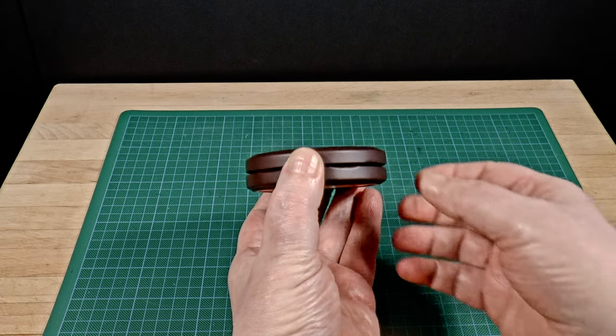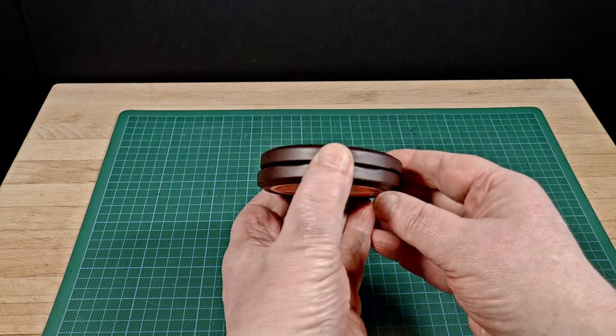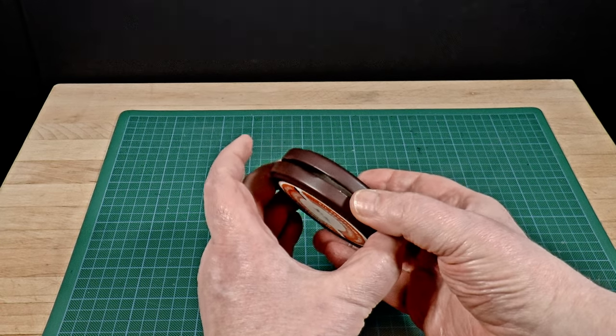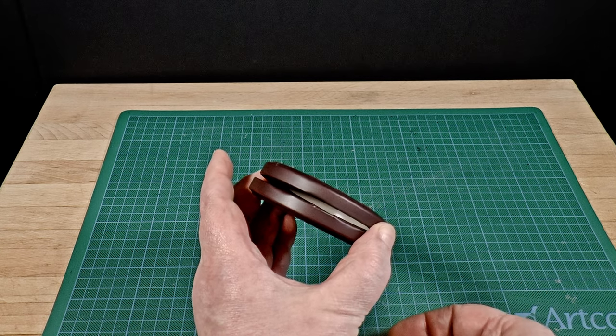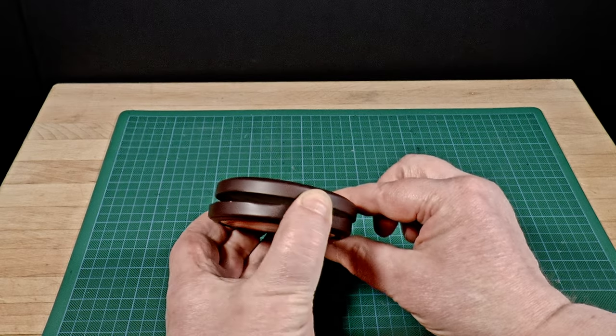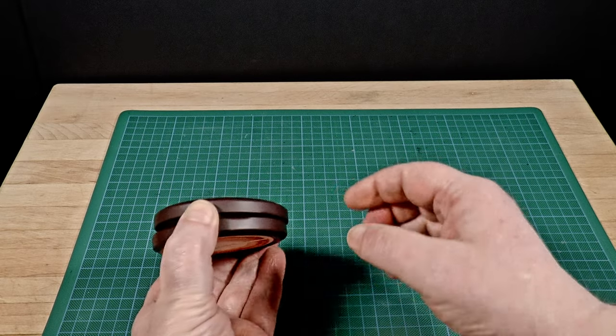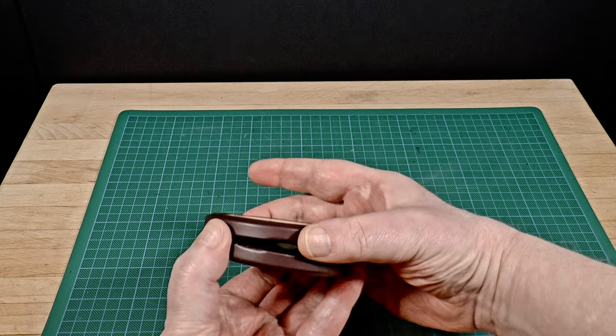Let me illustrate what's happening. Imagine that these two jar lids are flat burrs. If they're misaligned — that is, if they're not parallel — they'll touch at an angle. There will be contact on one side and a wide gap opposite. Big bits escape here, spoiling your Turkish grind and making espresso more difficult than usual.